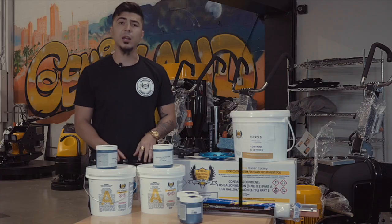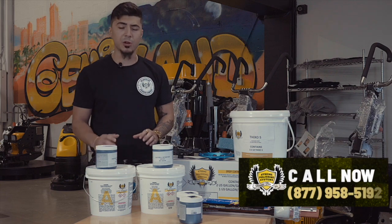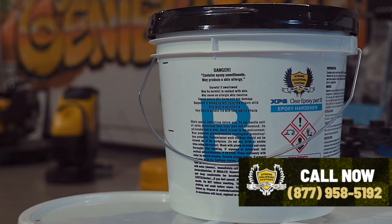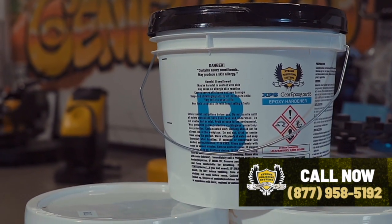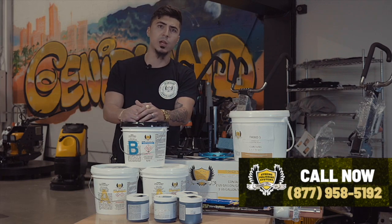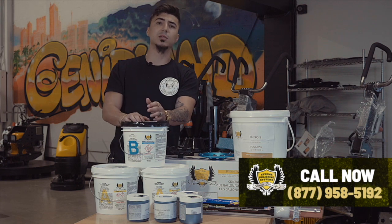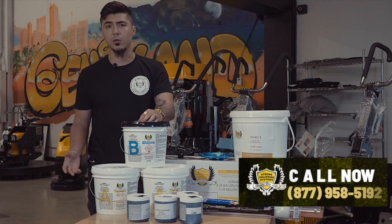And then when you're ready to lay this down on your actual floor, then is when you're gonna mix in your part B. So once you mix in your part B, you only have 15 to 20 minutes in the bucket before it starts kicking and smoking on you. So you're gonna wanna mix that up really, really good for about another 3 minutes. Mix it up so it doesn't smoke. And when you're ready, you lay it down. You throw it on your floor.